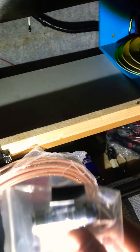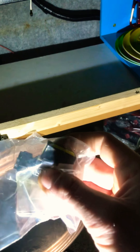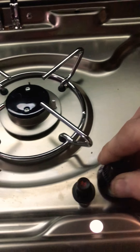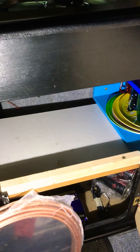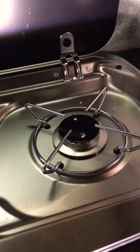While I was at Screwfix I also decided to get a little shut-off valve to go on the copper tubing. This gives me an extra added layer of security — if I'm on a campsite with the gas bottle switched on, I can have a safety valve up here, out of reach, which I can turn off. So if the youngsters decide to come along and mess around with it, I've got a fail-safe: I've switched it off under the cabinet and they're not going to gas themselves. Safety first — kids will mess around with things they shouldn't.